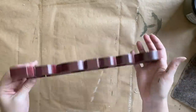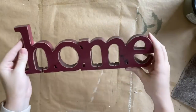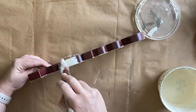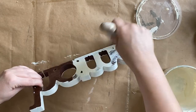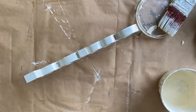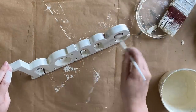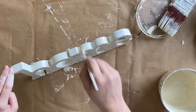Our second project is this little wooden home sign. I had it originally and it was knocked off a shelf so I had to do some repairs to it. We're going to give it a makeover today. I'm going to be using Dixie Bell's Buttercream Chalk Mineral paint over the entire thing and it's going to take about three coats for full coverage. You'll notice that I swap from my regular Dixie Bell Mini to a small artist brush — brush size is definitely key to getting a good finish. If you use a brush that's too big on a project like this you'll end up with lots of paint pooling, too much paint, and drips. So you definitely want to think about that when you're working on your projects.